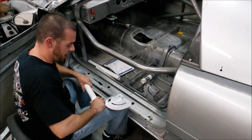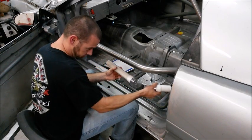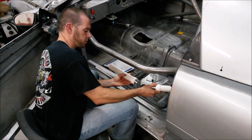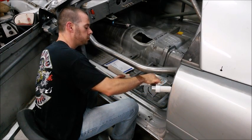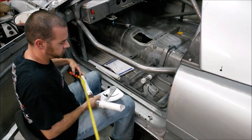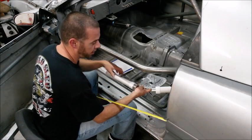Now moving on to the last half of the door bar, I'm going to have a little shorty piece. And same thing, I have my 6.5 inch center line already marked on my main hoop. So I'm going to come out flush to the existing door bar. Same thing, this is where friends come in handy. So I knew I was at 25.5 on my last measurement to the tangent of the straight. So getting everything lined back up.